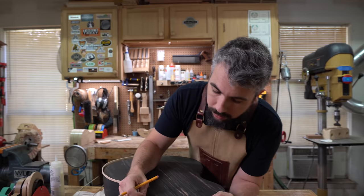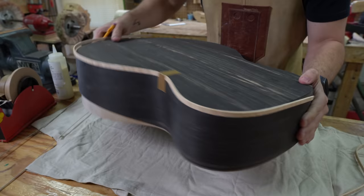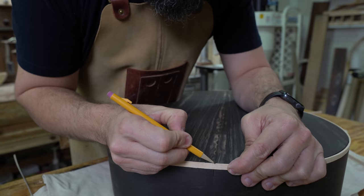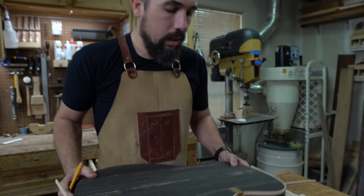We tape the binding in at the waste area, find the centerline of the guitar back, push it on nice and firm making sure there's no slack, bring it around to the centerline, and mark it. Remember, we don't need to cut it exactly to that line — I can actually cut it with a little bit of a gap right there. Nothing too crazy. We pull this off and grab some snips.